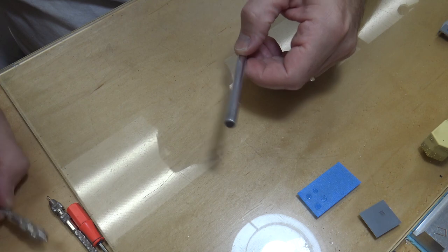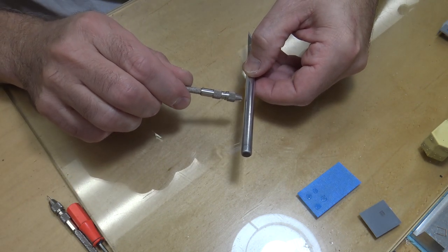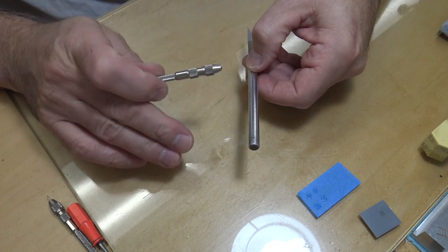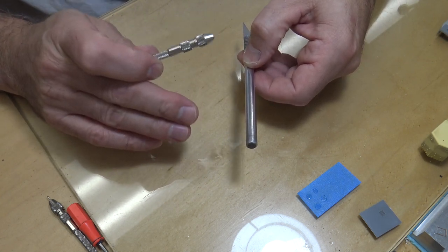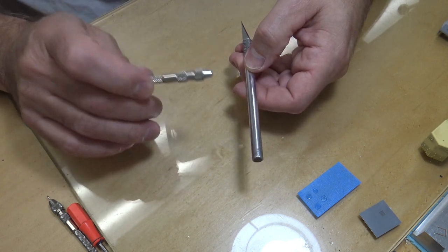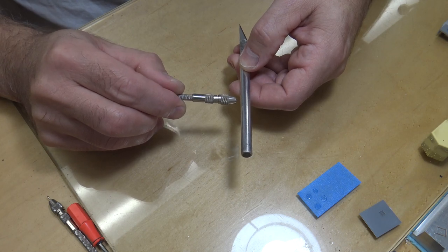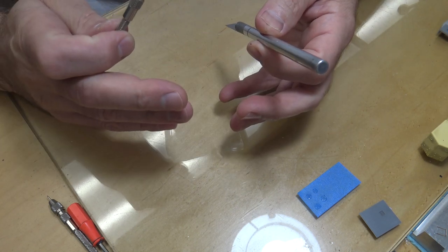So that's just a tip. Just spin it a little bit, very, very lightly. Also, if you don't make it the right size, let's say it's undersized, I showed you if it was oversized, you can just sand it around. But if it's undersized, just go right back to the soldering iron and spin it, and it'll continue mushrooming.